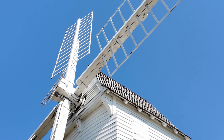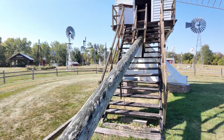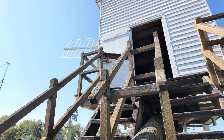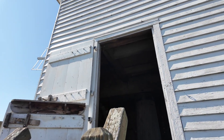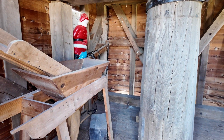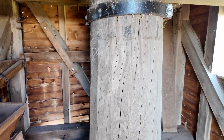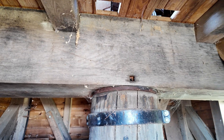Now let's go on inside. The stairs here at the museum are actually fixed to the ground and they don't rotate with this windmill. In production windmills, though, the stairs could either be on their own wheels to turn with the mill, or even fully supported off the ground. Typically, this mill is not open to the public, so I want to thank the museum for giving me access to film this so I could share it with you. The ground floor of the main building, called either the house or the buck, is dominated by the huge center post coming up through the hole in the floor and ending on a bearing, seating it to the massive cross beams which support the entire buck. The flour was ground above and came through a chute down to this floor for packaging. The good stuff's upstairs, so let's go up there.